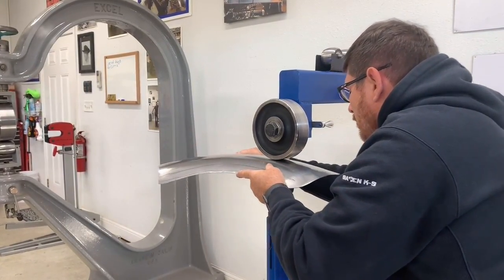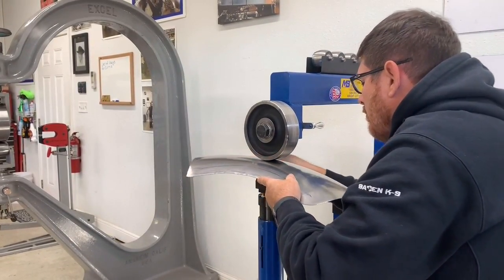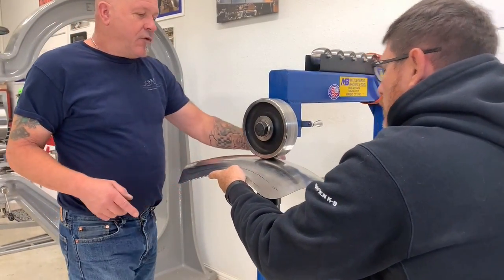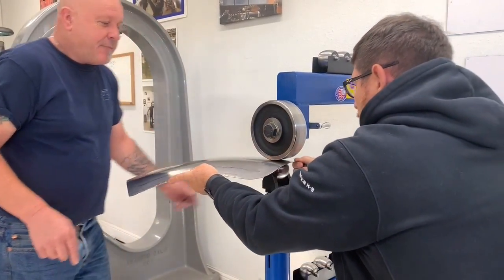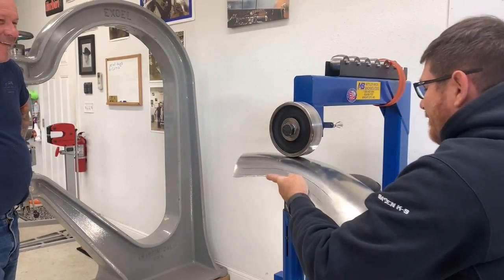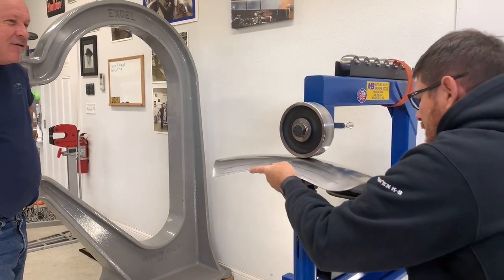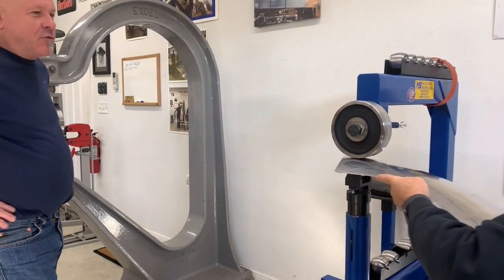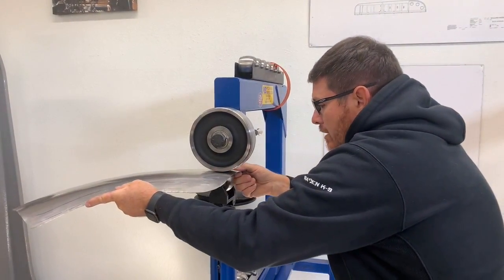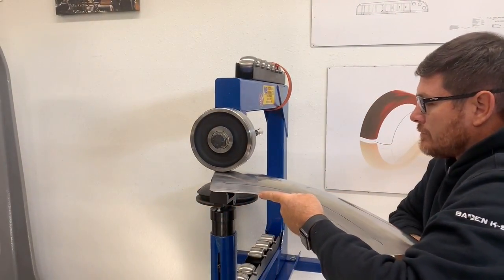So you notice how it's difficult for you to be able to wheel in the flow and consistent close to the edge because your hand's in that position. Right. So if you were to move this hand further over to here, move this hand back into here, now try it. Now your fingers aren't in the way and you can get a consistent run. You may have more body movement, but that's just part of wheeling. Because my body moving back and forth now takes the place of your step back and forth. Back and forth, right. Yeah.